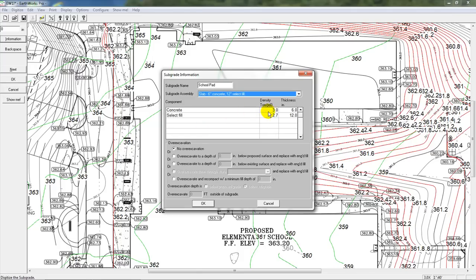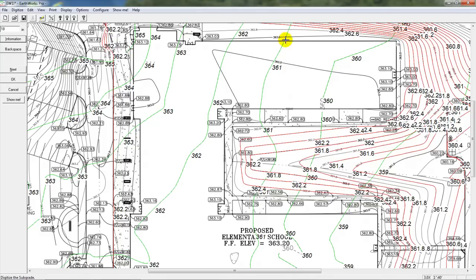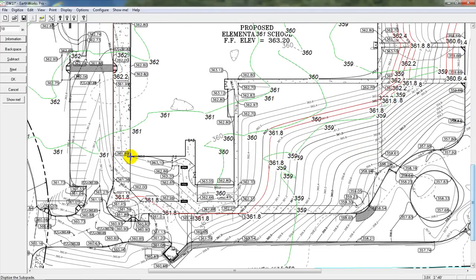And then from there, it's really just a simple matter of tracing the outline of the footprint of the building with your mouse. So you kind of go along here, you're really just clicking with your mouse, and make sure that you click right on the line. Just like when you used to use digitizers back in the day. So really, this is all you really do. We'll kind of move down here a little bit. You have the sticky line that follows you along what you're doing there. Kind of shows you where you are on the takeoff here. But we're simply really going around. I need to backspace, by the way. I can backspace a little bit there in case I go a little too far on one of the corners.